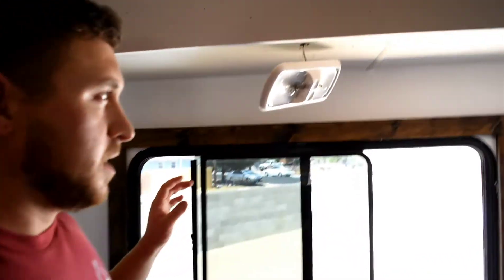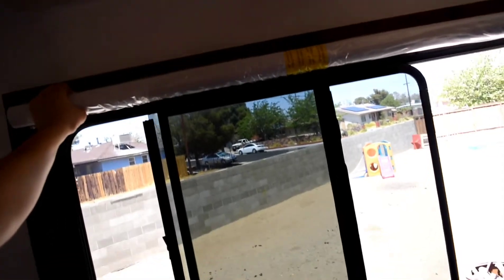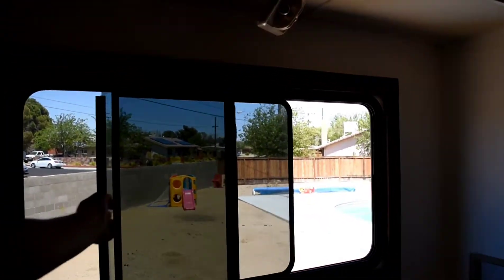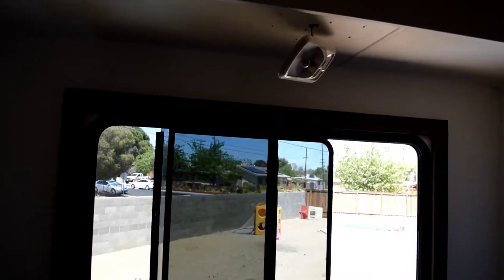What I did here was first measure the height of the window. I didn't want to make any 45-degree cuts because I'd probably mess it up. I'm going to get a block and cover this, and trim out all the tape and paint later. I like the box look because it feels more homey. I got that measurement, added the width of this — two and a half inches — so I added five inches to the bottom, and that's how I got that bottom and top cut.